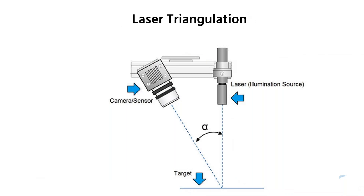The second method is laser triangulation. We arrange a laser and a camera in a triangular configuration so they converge at a certain distance or focal length. As the surface being scanned changes distance from the scanner, the laser appears at different places in the camera's field of view. If we scanned over a bump or raised area, the laser appears further to the right in the camera's field of view; if the distance increases, it moves to the left. So we can calculate the distance to a surface as long as we know the angle and distance between the mounting locations of the laser and camera. This is how Creaform's perennial favorite, the HandyScan, works — as well as laser scanners that come on Hexagon or ROMER arms.